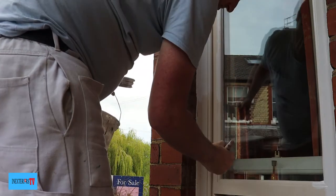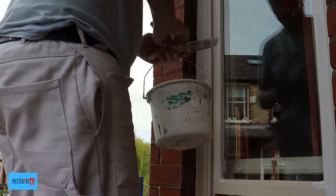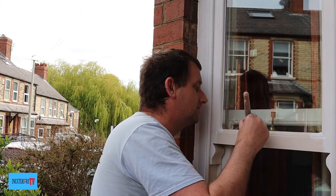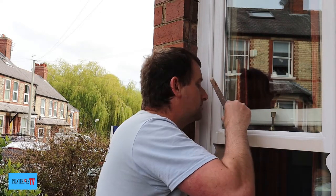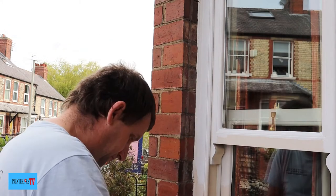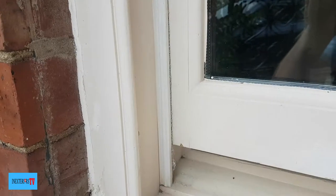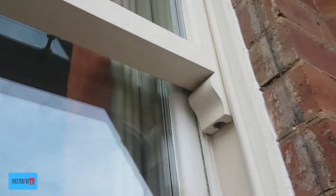You have your frame and then your inner sash bit. When painting the face of the inner sash, don't put absolutely loads of paint on it — you don't want it flooded, as that can cause the paint to stick and the window to stick. Now I'm painting the bottom part of the top sash. With the top part of the window completely painted, it's time to move to the bottom. You can see where the paint extends from where I crossed the sashes over to reach that hard-to-get-to bit.